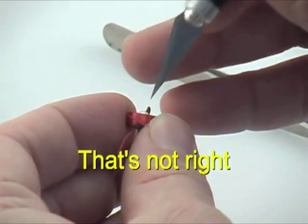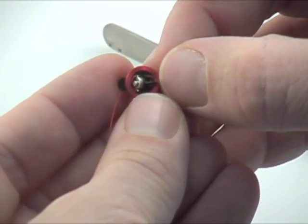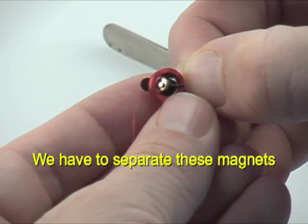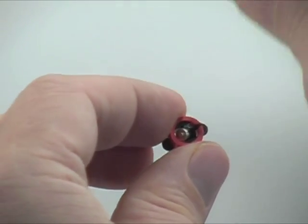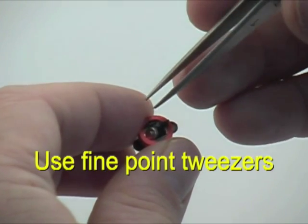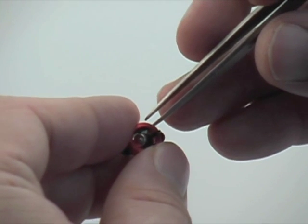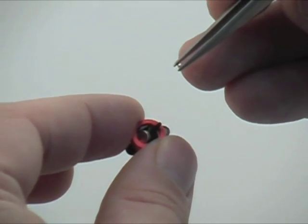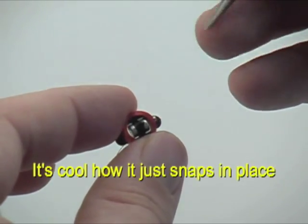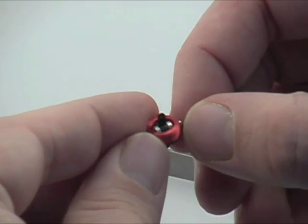Whoops — there's a mistake. If you get something metal close to it, and it's not glued on yet, the small magnet can fall off and stick to the central magnets. We're showing this so you can learn how to deal with this problem: get some tweezers and remove the small magnet where it has stuck onto the big magnet, just like so.